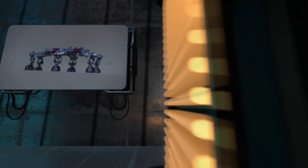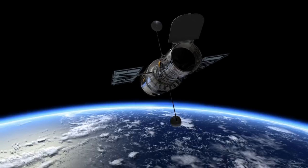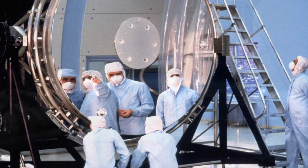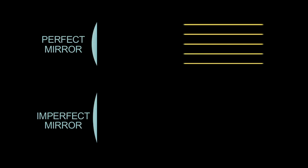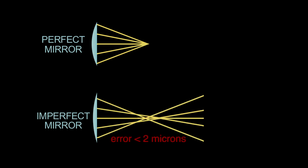We'll talk all about that on this episode of Crazy Engineering. The Hubble telescope is composed of several different instruments, and outside of those is something called the primary mirror, where all the light bounces off and goes into the instrument. That's where the flaw was. The problem was something called spherical aberration — the primary mirror had the wrong shape. It's a shallow bowl, effectively, that brings light to a focus, but it was a little too shallow. It rendered the telescope fundamentally unfocusable. All five scientific instruments on the Hubble depend on a sharp image — that's the whole point.